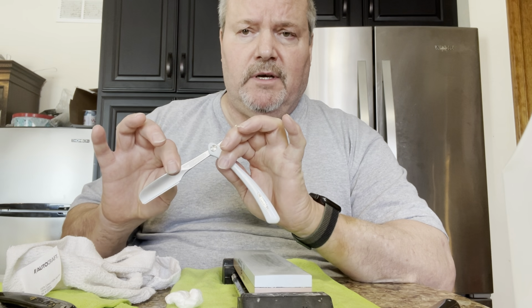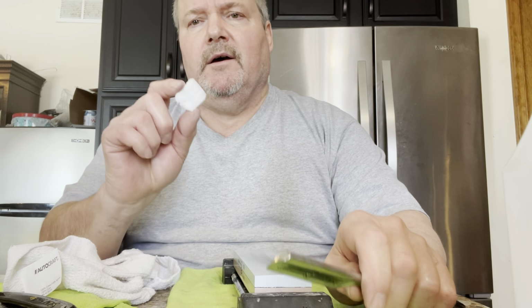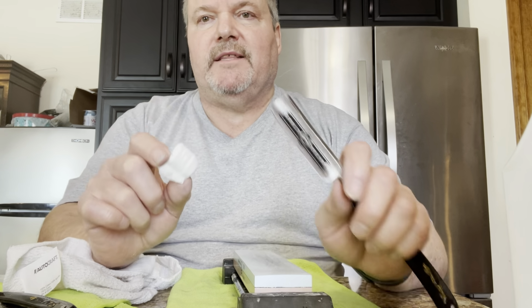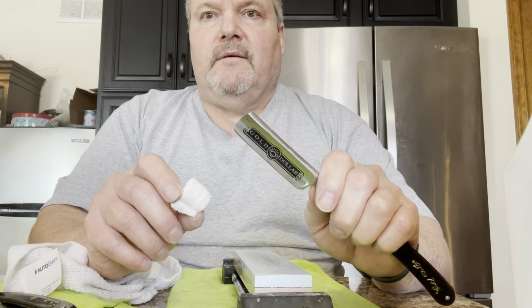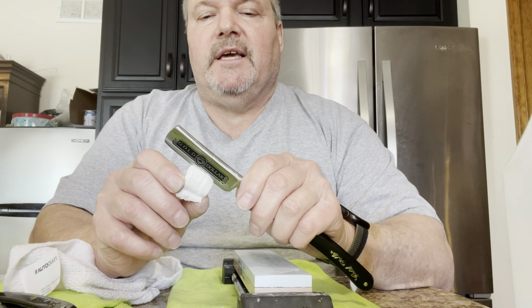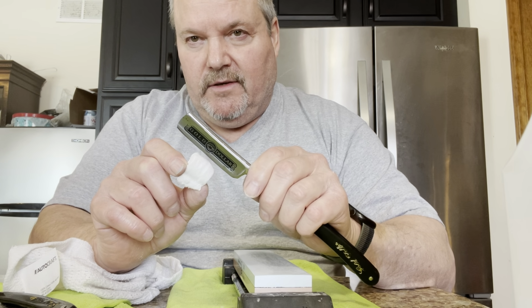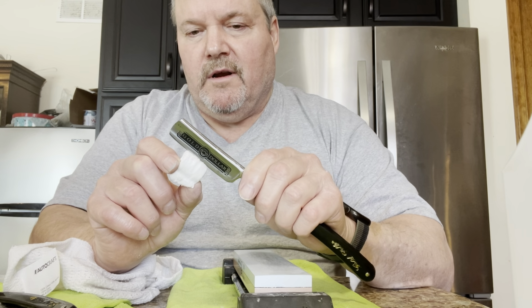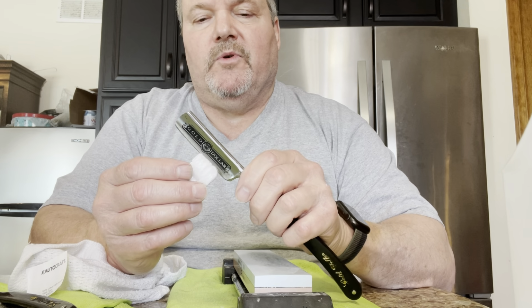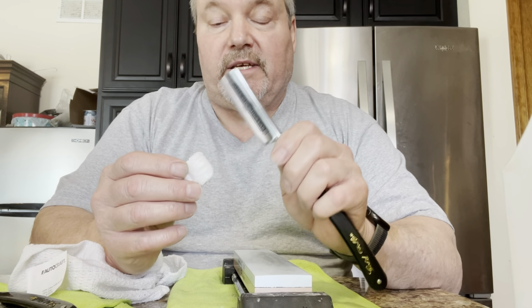is to find a tool. Again, I like to use the Feather Artist Club to be my benchmark for this. And the nice thing is that as I go through and increase the fineness of my grit, I also find that there's a progressive increase in the ease with which this will penetrate, whereas I need less of an angled cut, until I get to where, like right now, this does not do a very simple straight push cut, but a little bit of a lateral motion makes it go right in.